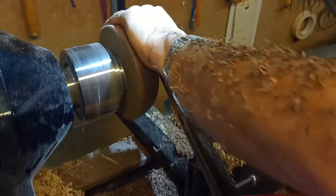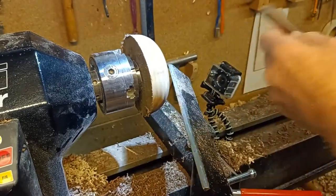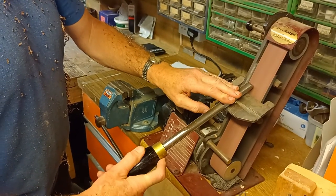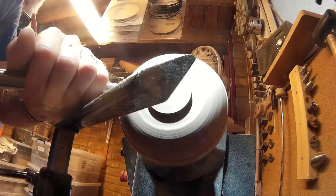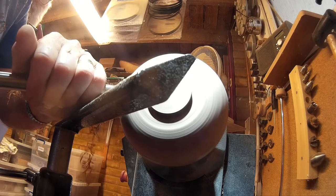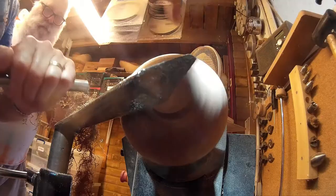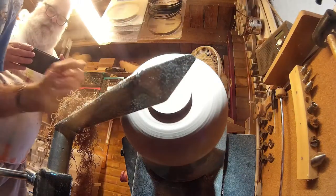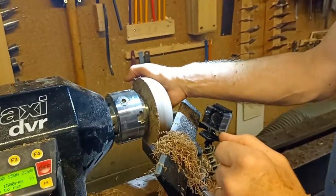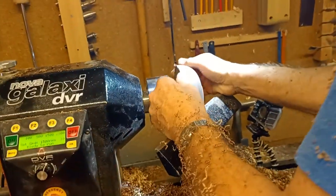Just have a look at that — I think that needs a little sharpen for the final cut. It's cutting a lot better. To look at the profile I'm not looking down here, I'm looking up there — looking at the profile against the wall as I'm cutting, because your hands know where the tool needs to be. They didn't when I was learning, but they do now.